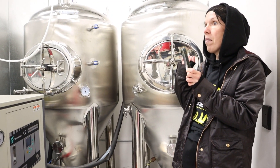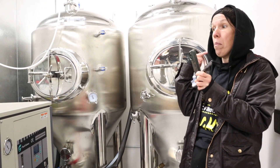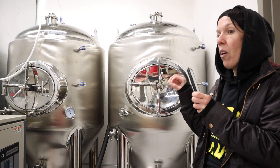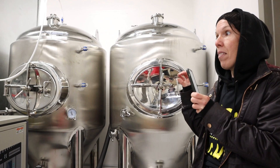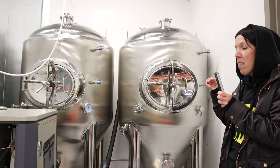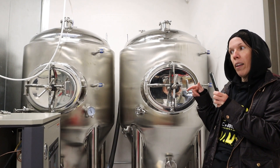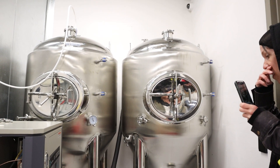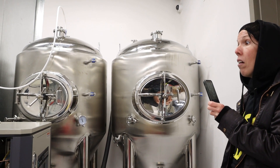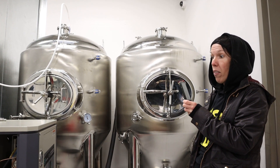Just really quick — I'm going to talk about this again in a separate post. The loudness of the pumps moving the water: there's normally a muffler that comes on those so it dampens the sound and it's not so high-pitched and clappy. What is necessary and needed is an air dryer on your compressor. A lot of labs mostly have those, but this one does not have one. So in that case, it's going to create a situation of freezing on the pump. The mufflers were taken off to mitigate that — that's why it was loud.